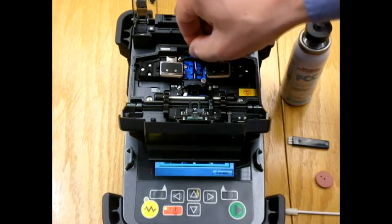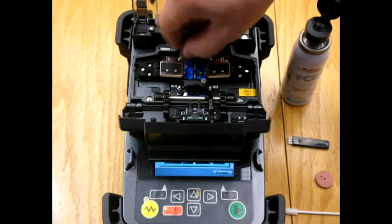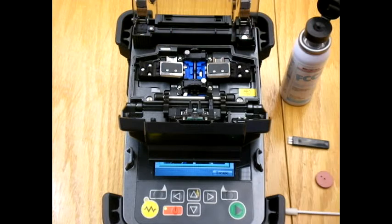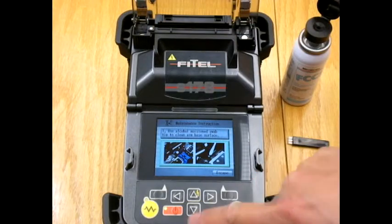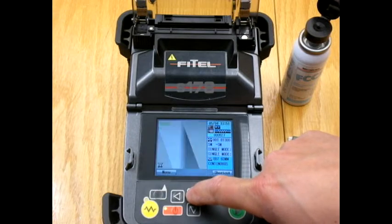Then he places it back in the machine and encloses the clamp — just a finger-tight turn, no extra pressure required. After we clean the electrodes, we'll do up to 10 arcs just to make sure that the unit is clean and all grit and impurities are removed.